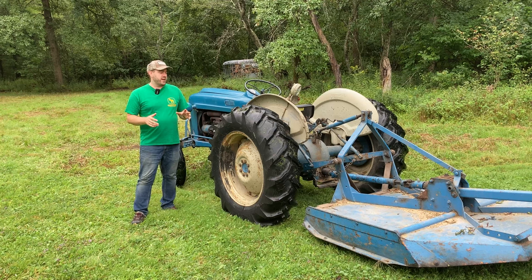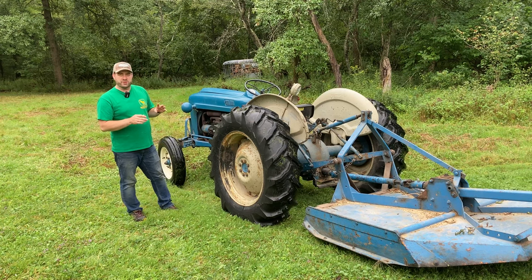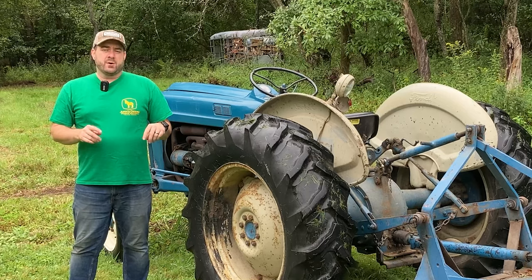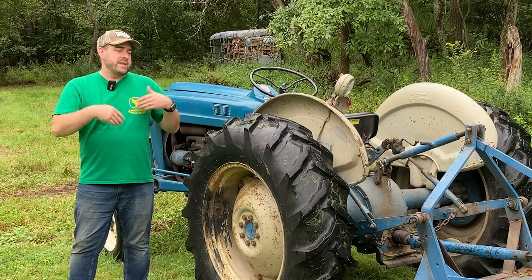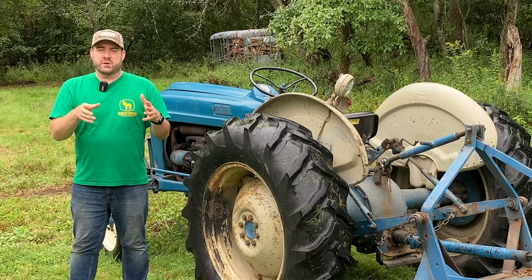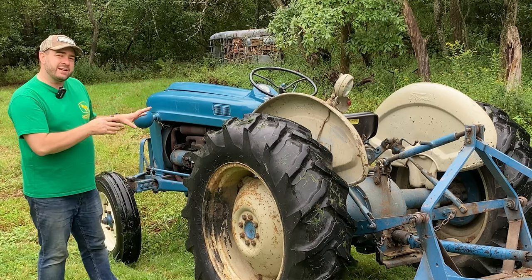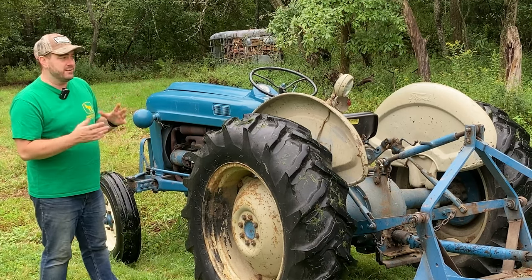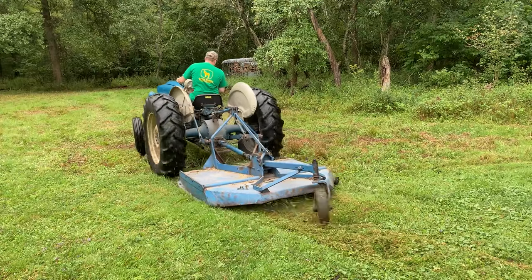So what I noticed yesterday was when I'm going downhill here in the backyard, there was very little load on the tractor, it would run fine. When I turn around and I'm coming back up a little bit of a grade with the brush hog running, that creates that load on the engine. That's when it would surge and you could actually see the whole tractor surging. We'll see if those slight carburetor adjustments helped us out here. Hopefully, because I'm hoping it's that easy of a fix.